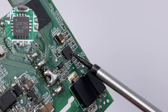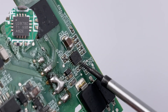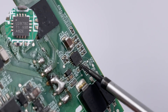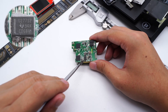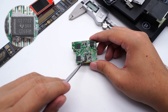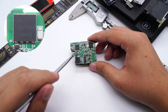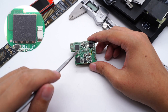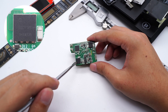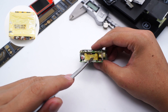The primary controller comes from Texas Instruments, model UCC28780. Its working frequency can be up to 1MHz, and it can support GAN FET and integrates multiple protective functions. The driver also comes from Texas Instruments, model UCC27712, with dual inputs and output interlock. The two MOSFETs of the primary circuit are Infineon CoolMOS IPL60R185C7, rated 600V 185mΩ. Here is the transformer.